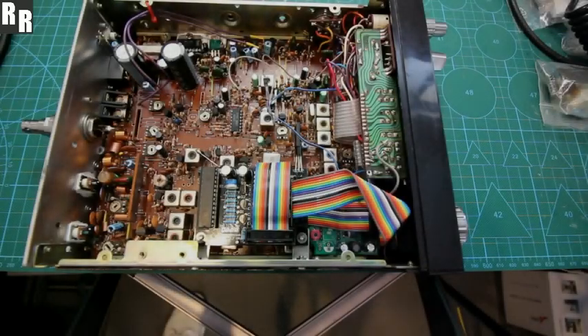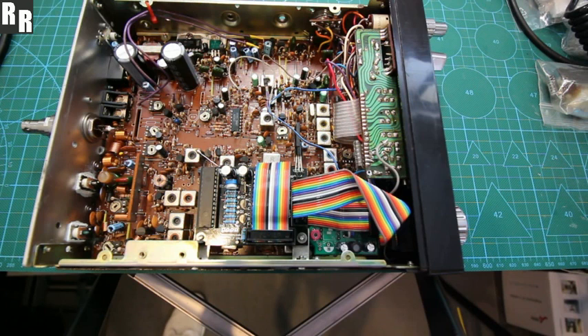Just a physical look at the installation of the Digimax Lite channel kit board, which is reliant on the RR824106 version 1.0 PLL adapter board in this case. That Digimax kit will not be able to be fitted into these radios because of the UPT2824 PLL, which is ROM 40-channel locked. So I designed this PLL adapter board to be able to connect a MC145106 PLL in there.